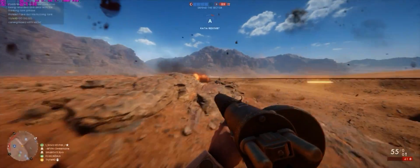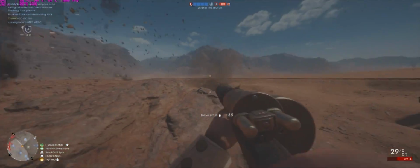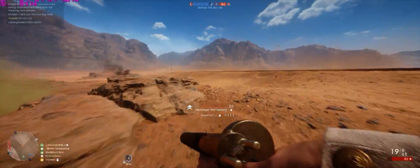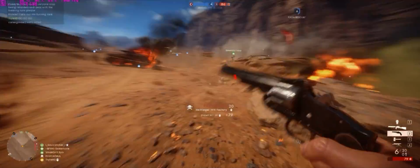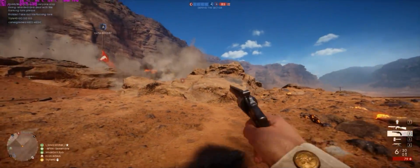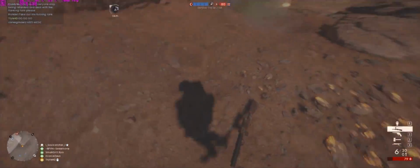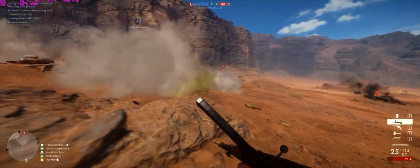To my surprise, this made the card boost to 1900 MHz without an overclock, and even after an hour of playing Battlefield 1 maxed out, it hovered around 58 to 59 degrees Celsius. Bearing in mind my room can get exceptionally hot, that is more like it. If you're curious about fan noise, you can't hear the fans at 70%, with the side panel on and headphones off. You can hear it at 100%, but anything under, I'd say, 80% is pretty inaudible.